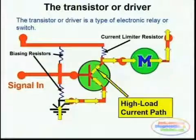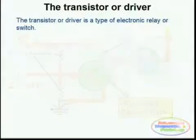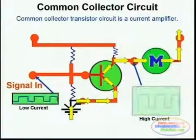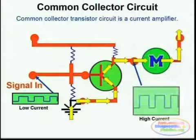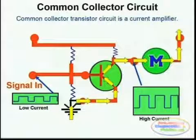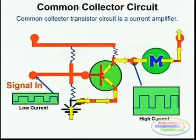Transistors can be pulsed, and this is the reason why they are widely used throughout automotive systems. They can simply be pulsated, as we see in this schematic, and a small pulse at the base triggers a high current change at the output, therefore controlling the load. So again, pulse control transistors are the basis for duty cycle control devices.